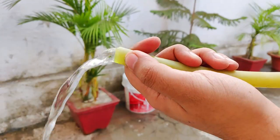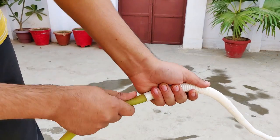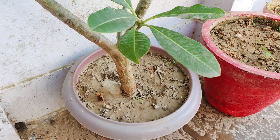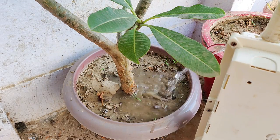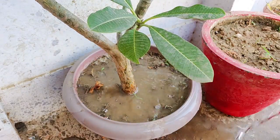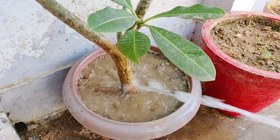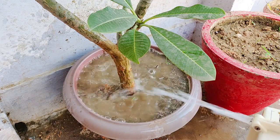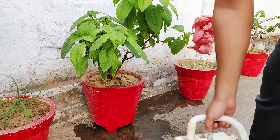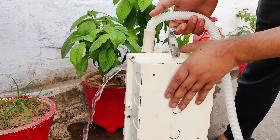Here as you can see this is the pressure from the tap water — very slow. This is the extension pipe that goes to the booster pump, and here this actual pipe connects to the tap. That's the normal pressure; let's boost it with this switch. It's filling up really fast. Okay, so this is the normal pressure we get — now let's boost it.